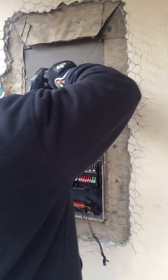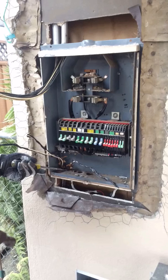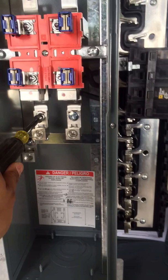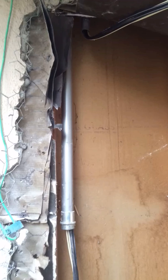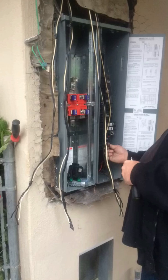Here you can see where the hub is going to be for the new pipe. Since it's a 200 amp panel, it's going to be a rigid pipe. Here you can see the process once we're taking the panel off. The locks I'm talking about are the bottom ones — we gotta swap them to the top. There are also two pipes that are going to be interfering with the PG&E side, so we had to cut them up and use flex into the new panel.